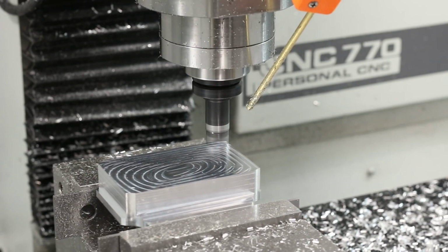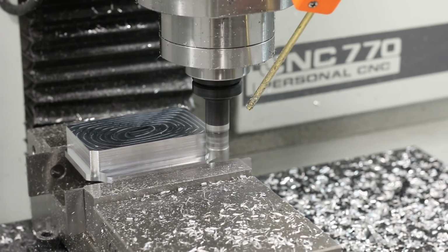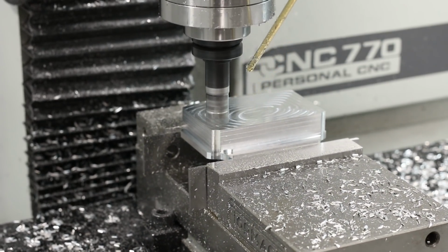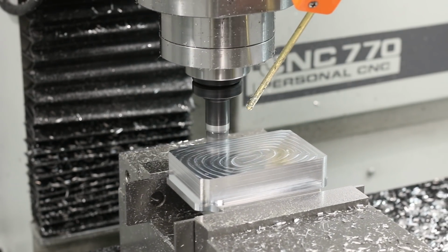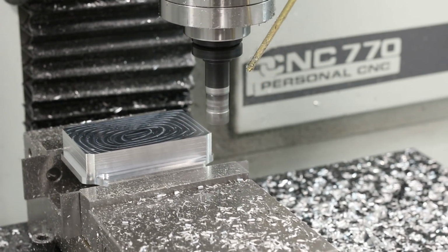It's also worth noting that I machined this in 2 parts. Originally, it was just going to be an aluminum prototype plate to hold the mod vise in it, and we were going to make a final version out of steel later, but we decided that the aluminum would do fine, and we just adjust it slightly to fit drill bushings in instead of making the whole plate out of steel.